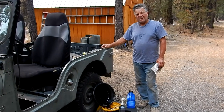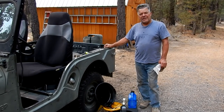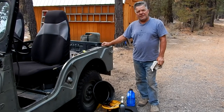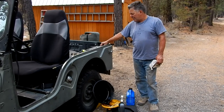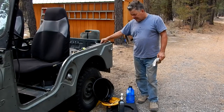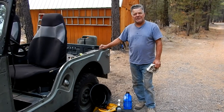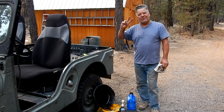We're finished with our project. We refilled both the front and rear differentials - the rear is a Dana 44, the front is a Dana 25. We checked out the gears: there was a little pitting on the back ring gear, nothing noticeable on the front. I didn't feel any metal filings or pieces in the bottom of the cases. All cover bolts are half-inch. Our pump worked great. It's not a really hard job but it does take a little time, and you'll probably want to put new gaskets on if you can. Good luck working on your Jeep, have fun getting greasy, and we'll see you in the next video.